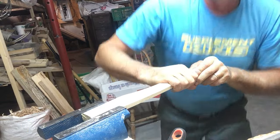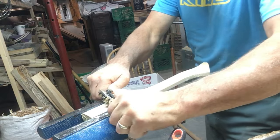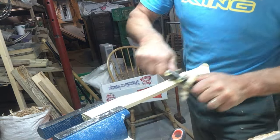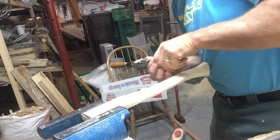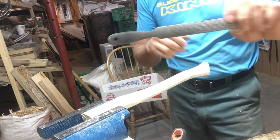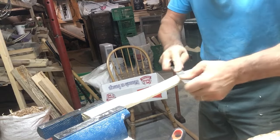Let's finish up here — I'll show you what I'm doing. I'm taking my spokeshave and just going to smooth up the top part of the handle, leaving that octagonal shape. I'll go along my existing corners and angles. This one here has been done, and then I'll do it back this way because I'm against the grain. Now I'll take the other little rasp and put some lines in the bottom part of this octagonal to give him good grip.